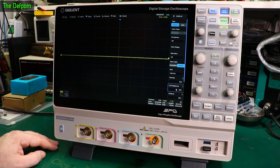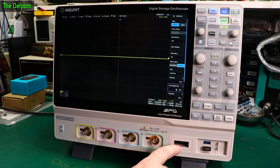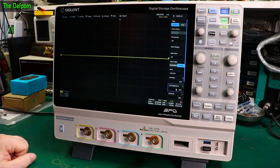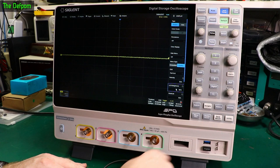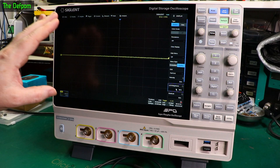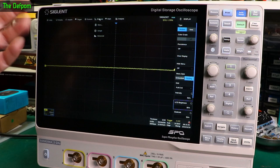Things to notice: this MSO port here uses the same MSO probe as the 2000X Plus does — I think maybe the same as the 5000 as well. That one which I built for my 2000 will work on this one too. So if you've got one of those probes from an earlier generation scope like the 2000X Plus, that logic probe — you can use it on this one as well. You don't have to buy any new probe to use this scope. That's quite a nice feature. The scope itself has auto sensing to detect whether it's a 10x probe or standard.